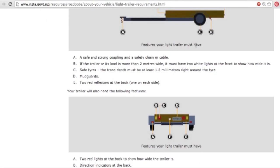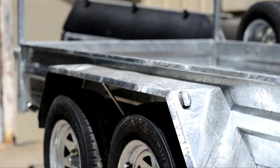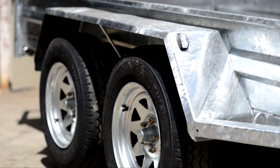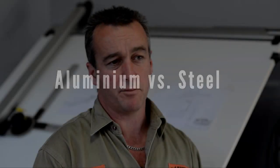You're limited to 3,500 kilos. Any trailer over 2,000 kilos must have brakes, and when you get over 2,500 kilos it must have an automatic breakaway system. So those requirements will have to be considered in the overall design.